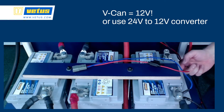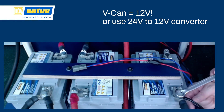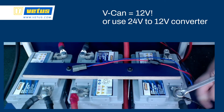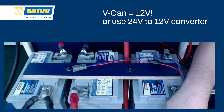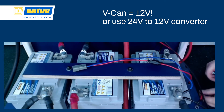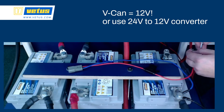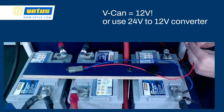The network has to be fed with 12V. The best battery to use for this is a 12V house or service battery. You can use a 12V starter battery as well, but if you get the occasional error, possibly the 12V isn't clean enough — there is noise on the line. In that case, use a 12V to 12V converter.